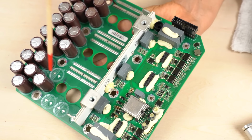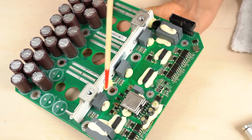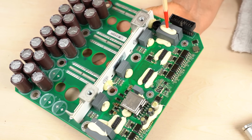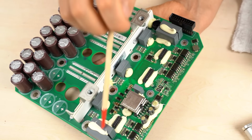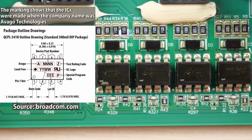In the process, some noise or voltage ripples are generated. To prevent the influence from such noise, these film capacitors are mounted near the gate driver circuit because they can filter the high frequency component. They are placed closely. There are DIP components here.